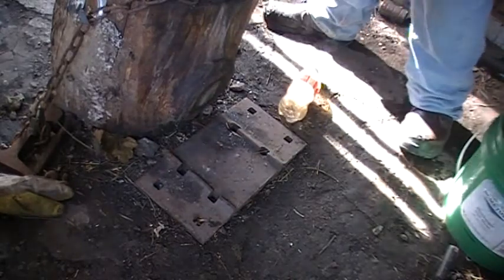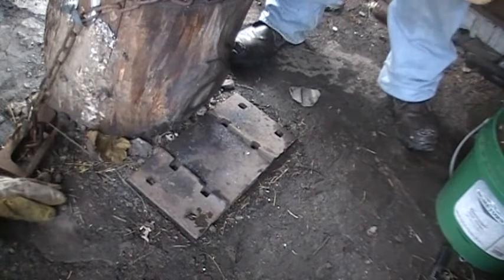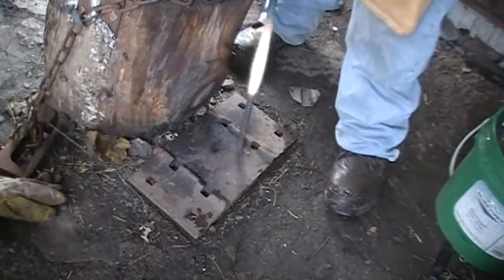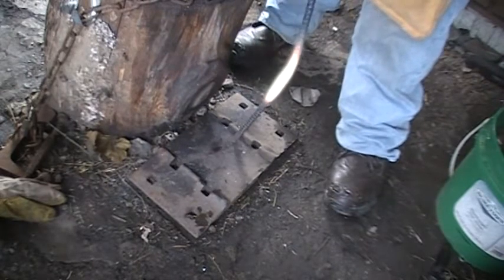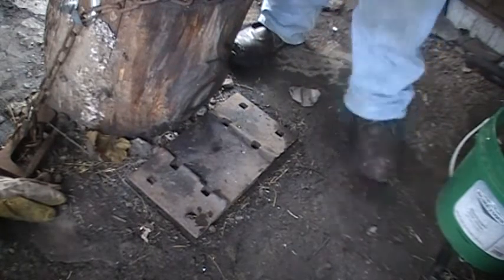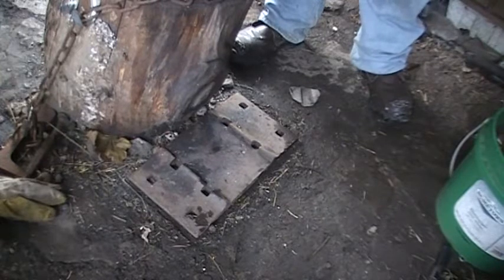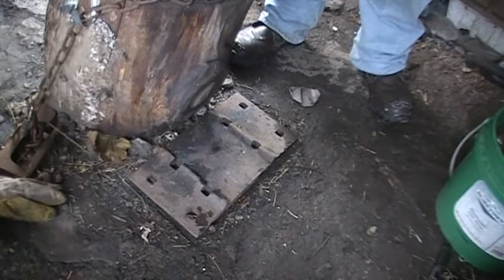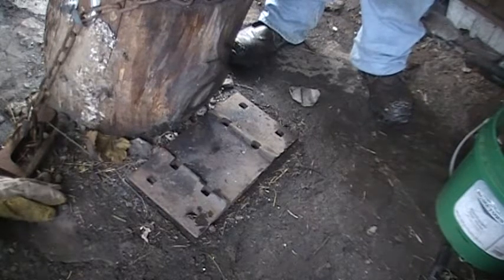And so we'll go back to the heat. Now remember, whenever you're upsetting, you want to keep the material straight as possible. Once you get a bend in it, it's only going to bend. It's not going to upset anymore. So remember, keep your heat isolated and not too long. That'll help prevent the bending. And then try to keep it as straight as possible.